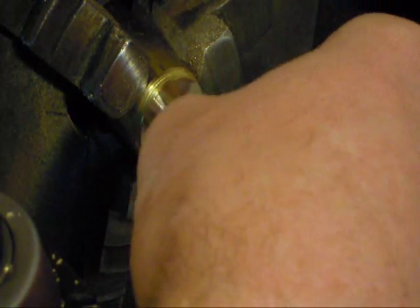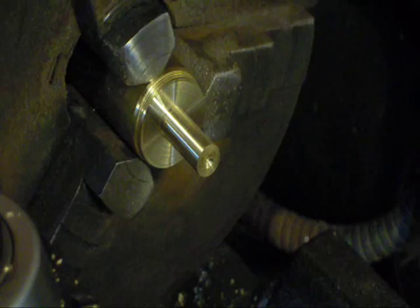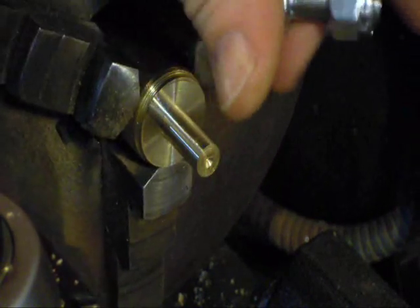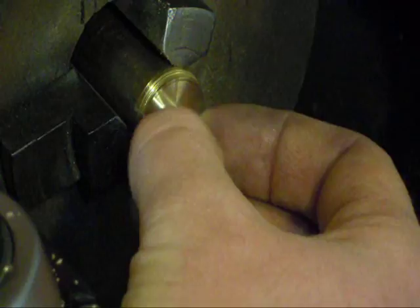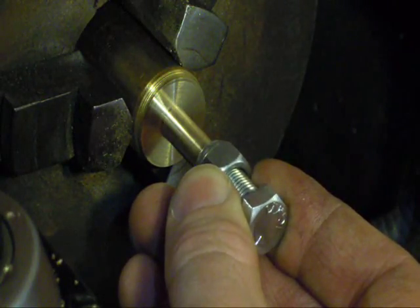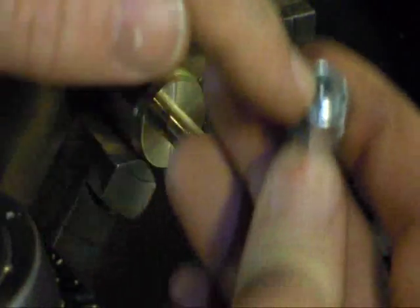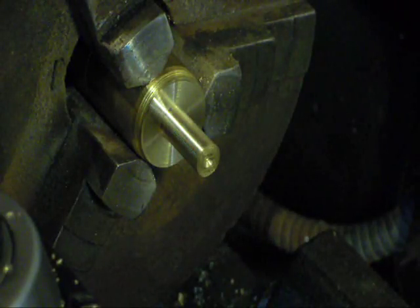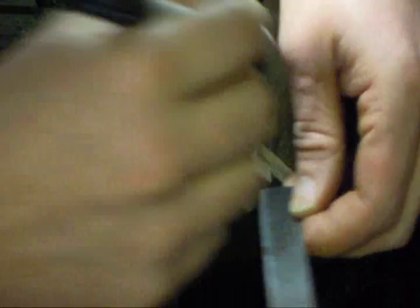I have a — I think this is a seven-eighths piece of brass stock. Way too much material but I have it handy. My bolt diameter is about 360 thousandths to the top of the threads, so I'm cutting this guy down to 325 thousandths. I'm hoping to get down past my threads — looks pretty good. The 5/16 thread depth is usually 40-something thousandths, so I might take it down a little further, then cut our 153 thousandths shaft to fit inside and part it off.